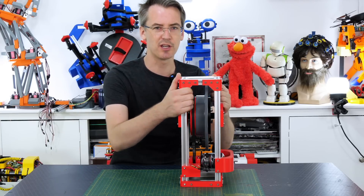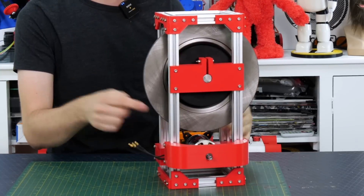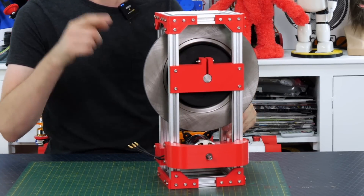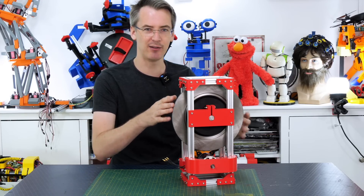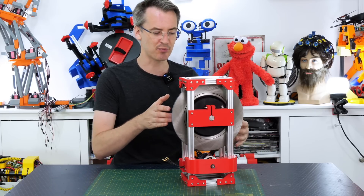So as I turn it this way it's making a force this way. The motor helps as well because that's quite heavy, and the belt drive means the motor's turning in the same direction. If it was a gear reduction it'd be turning in the opposite direction, and that would actually cancel out the gyroscopic effect with the mass of the motor and its own gyroscopic effect.